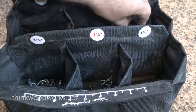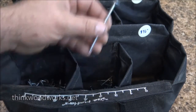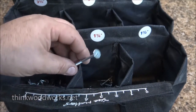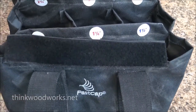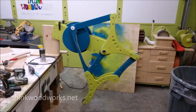Because I wanted to be able to take this thing apart completely and make any changes I needed to make, I wanted to screw it together. Regular screws probably wouldn't suffice — with all the torque and pulling and different pressures on it, the small heads on an average screw would definitely pull out. These are power head screws, designed for cabinet making and installation, and I used them for the entire build. They hold the body, the legs, and everything together, and have been holding up wonderfully.